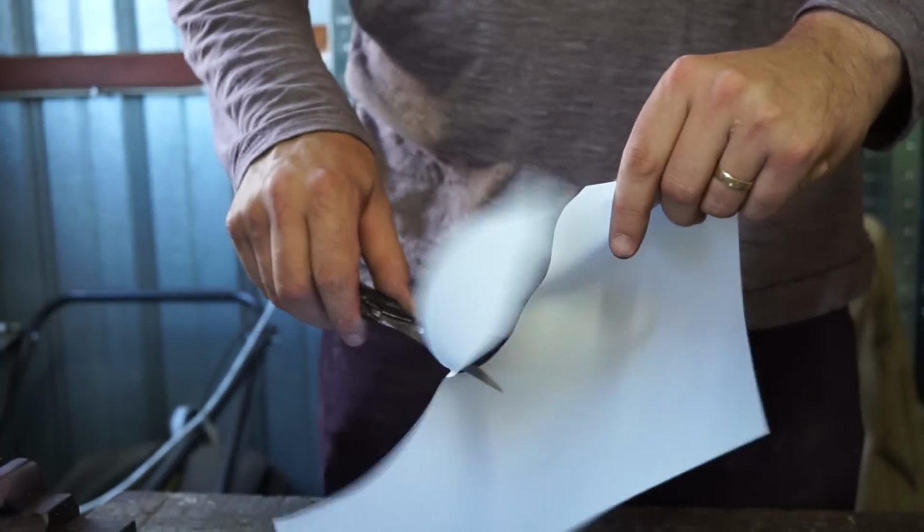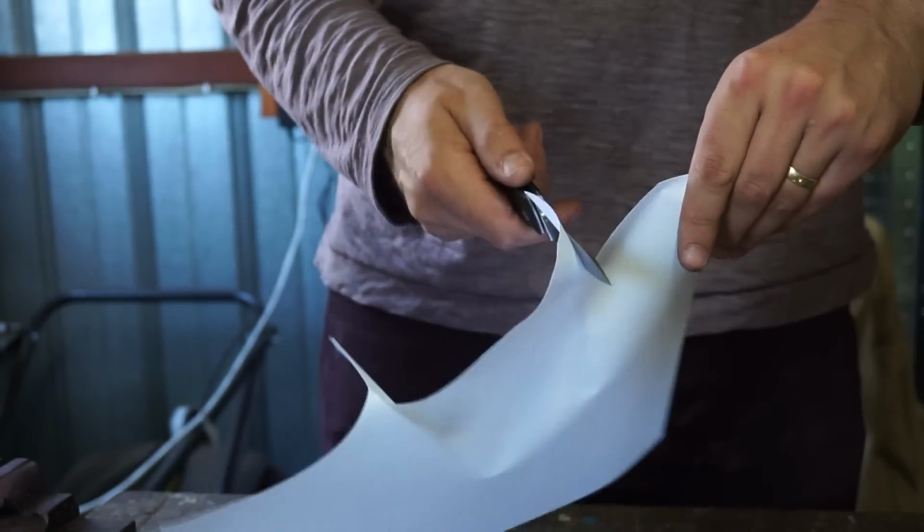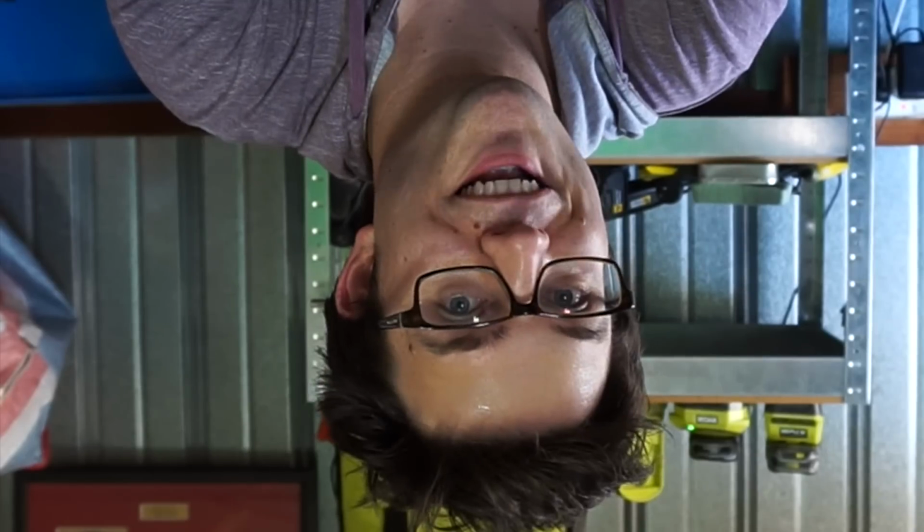It definitely felt superior to the factory edge. So now the knife is sharpened with its 1500 grit diamond edge and then a 3000 grit Tormek paste strop. Let's travel to the place we know and love to see how it's worked out, the knife lab.